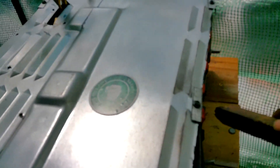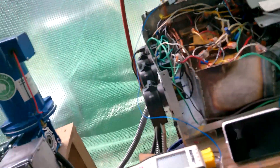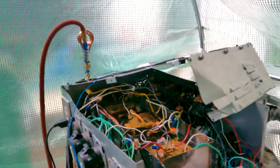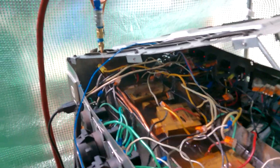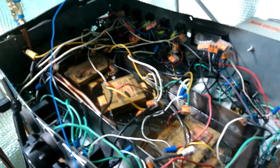Transformer two actually just had a short. You can see the top of it has a bit of carbonization — I think it was too close to the top and it arced through. I just want to remind everybody that right now, this is the most dangerous part of this whole reactor. This singular transformer is more dangerous than this thing exploding, because you will instantly be gone if you touch that when it's on. I always use a stick to even turn the switch on so I'm already far away. It turned out to be one of the secondary leads in contact with the metal that holds the oil from the transformers. This voltage is so high it pretty much jumps right through insulation — it doesn't give a damn about it if it's close enough to metal. It'll do the exact same to you. Don't ever touch it if it's on. I don't care how insulated it is — triple insulated. When this is on, I never touch it. Not even with a stick.